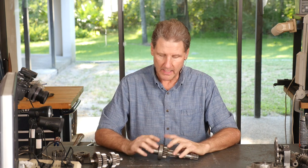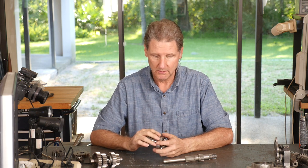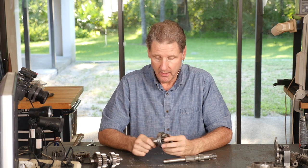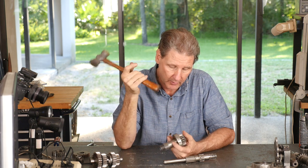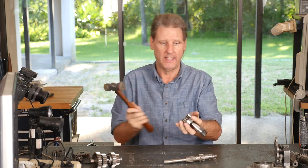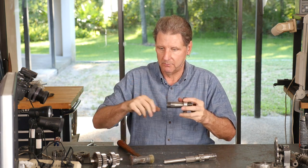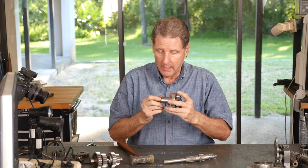We're going to put together this later model one. I mentioned hammering on these gears - you're not supposed to hammer across the race of a bearing, because the balls get dented. The way Duncan Keller at Yankee Ingenuity in San Jose taught me: if you hold it in your hand, don't put it on anything hard. Use a soft rubber mallet and hold a piece in your hand so it's got some compliance. You can tell when they're dented - thump, thump, thump.